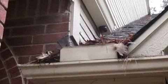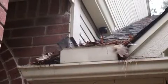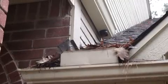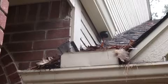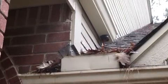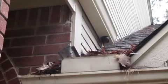Leaves and debris in gutters may not seem like a big deal, and in the short term it's probably not. However, leaves and pine needles and debris can harbor moisture. Over time, this excess moisture can find the smallest hole in your fascia and start to cause rot. And a lot of wood-destroying insects love damp wood.